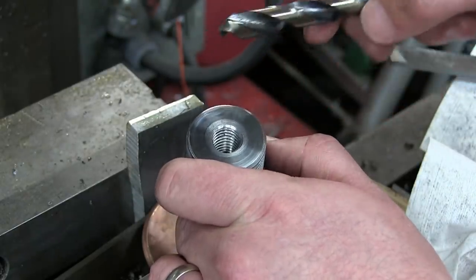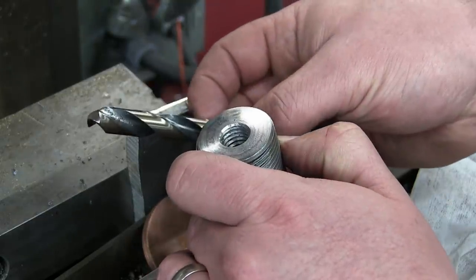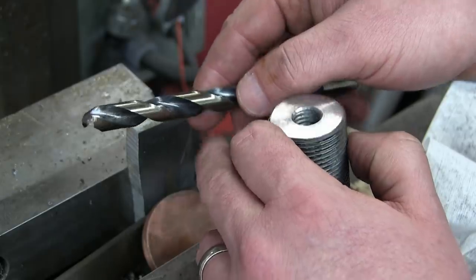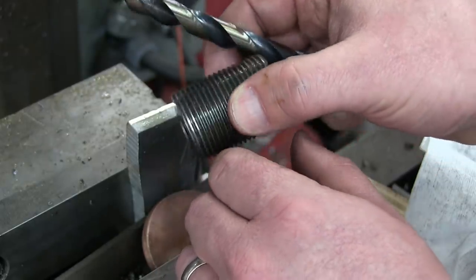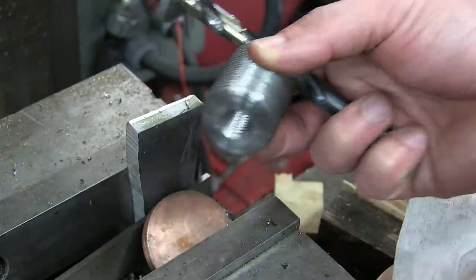Sometimes you just need more feed pressure so you don't get that weeble wobble effect. And luckily I invested in good proper drill bits, because Chinesium, I mean, not even a chance in hell would that have gone through. That was a right pain right in the cunning linguals, but she's done now.